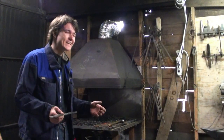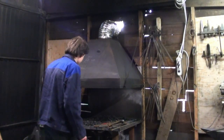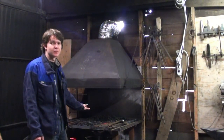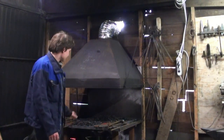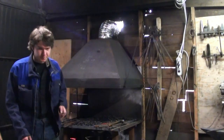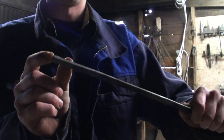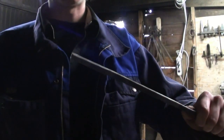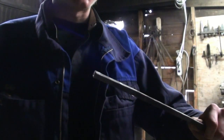The fire doesn't have to be that clean yet. But firstly I'm going to heat it up — just imagine it being lit. The blower is very noisy so I'm not sure whether you will hear me. But let's say I'm heating it up and I'll take it out. I make sure only about this portion is hot — only about this portion — so you can upset this and forge your scarf so you can get a good bond later when welding.